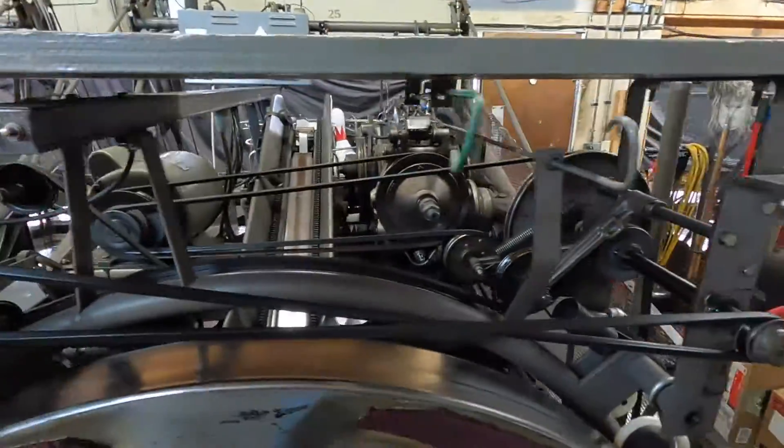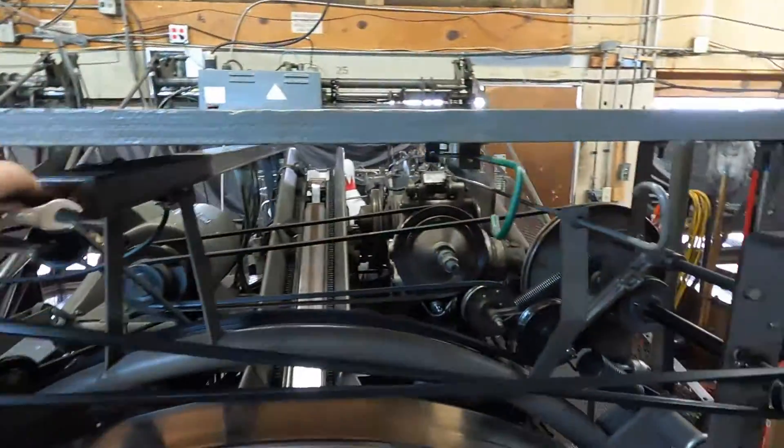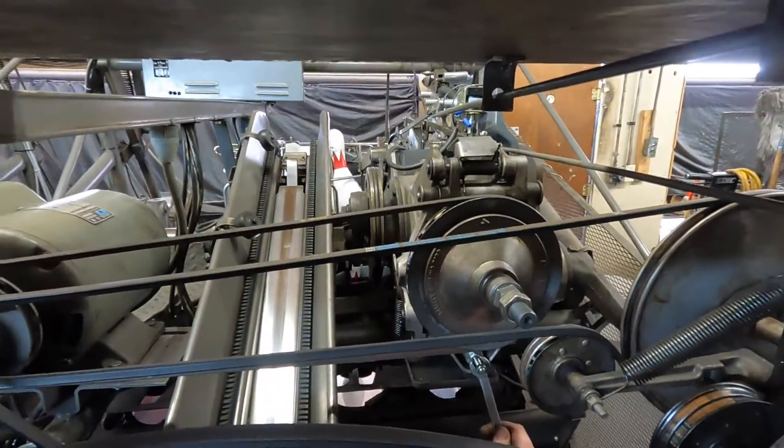When you're doing this, make sure this is completely off both switches, and make sure that your hands are clear of anything that will be turning — mainly your tension pulley and your clutch.